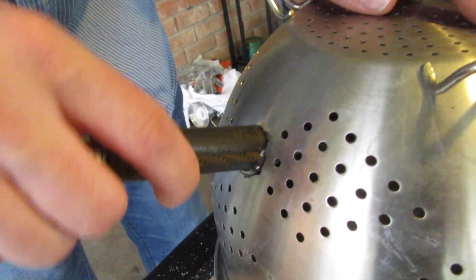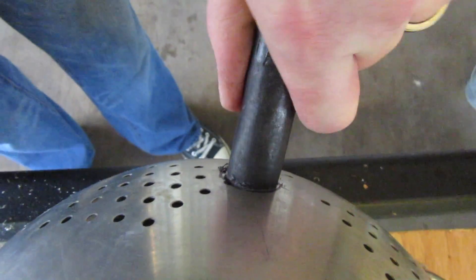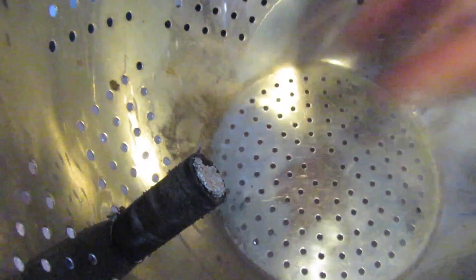Hole is done. Does it fit? So we don't want plaster being lost down our pipe right there — plug it up. So now we're gonna mix up our plaster with some sand. The sand helps to reflect the heat back in and the plaster insulates.